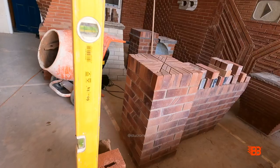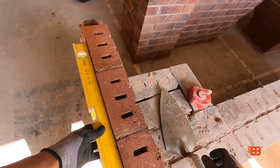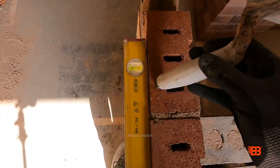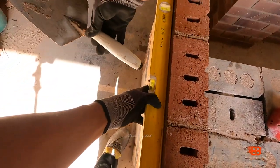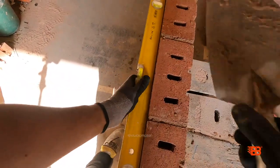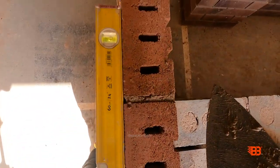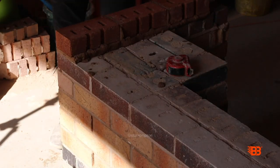Point B reference — see that. And then we can range them in. You can see there's a bit of a discrepancy there — a lot really. There's daylight in between here and daylight here. So this middle brick wants going over. I'm just going to hold that in the middle of the faces, knock it over. Clean the level first — if I can't see any daylight, rub it up to the top. Making contact with the level, scraping any excess.